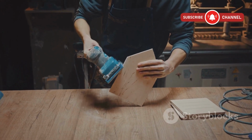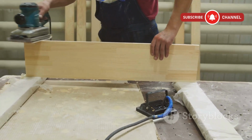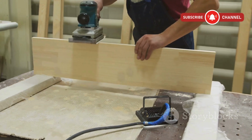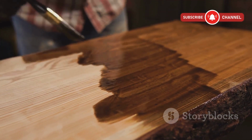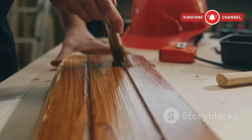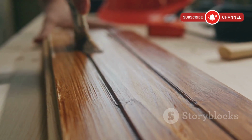Next, sanding. I go over the whole frame with 120 grit sandpaper, then finish off with 220 for that super smooth feel. For finish, I'm choosing a dark walnut stain to really bring out the grain. Then I seal it with a clear polyurethane coat, matte or satin, totally up to your style.